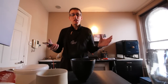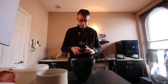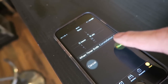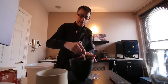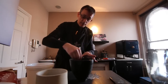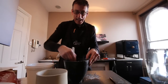You may say 9 minutes, that's easy — all you've got to do is mix and pour it into your flask. But no, I have to get all the air out of it, and that's where I'm going to use my investing table. I should, in theory, be wearing a mask because this is silica and it is quite dangerous if you inhale it. I try obviously not to inhale it. I have to give this about 2 minutes mixing, and as you can see we can't really help but get air into it.